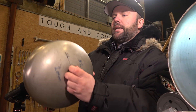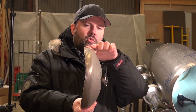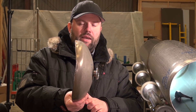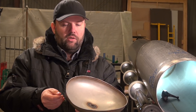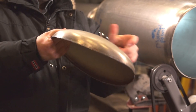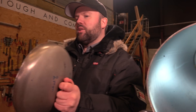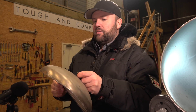We also know that this end cap has changed shape significantly — it is way more spherical or half-spherical than it should be. That's simply because it was stressed so much that it was more and more starting to act like a sphere. So perhaps an idea would be to use end caps of a slightly thicker material next time, to make sure this part deforms slightly less.